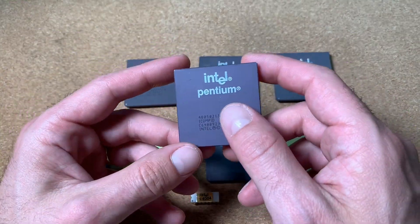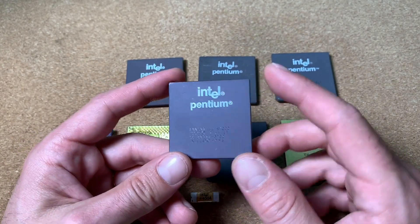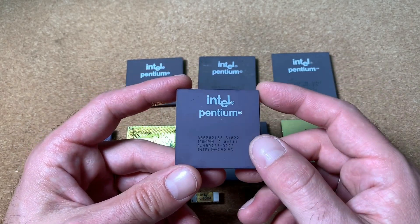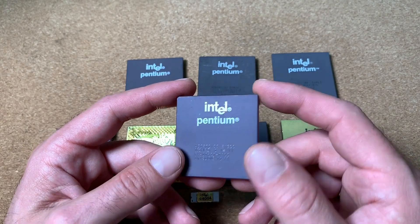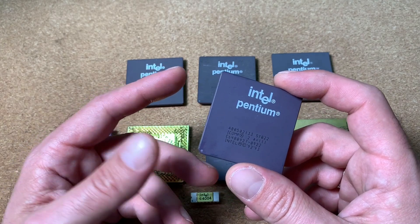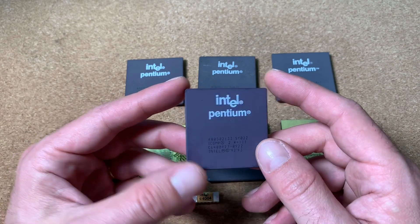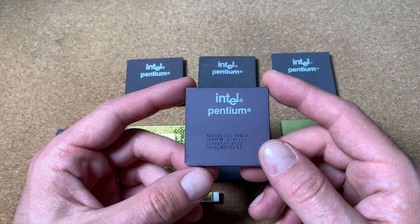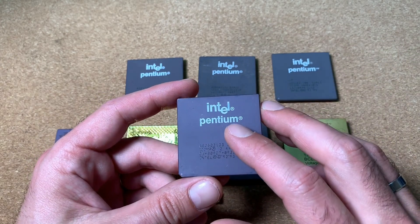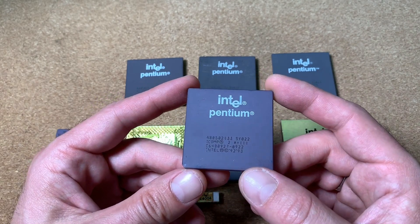This kind of Pentium CPU came in several speeds, from 75 to 166 MHz. They were all basically the same CPUs, just tested and manufactured for different speeds, with a certain tolerance of course. A manufacturer will always define the speed to the highest possible performance under the consideration of high reliability. So the idea of the crime was to use these tolerances and reprint the CPU to a higher clock speed.